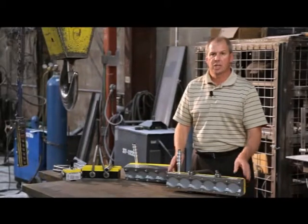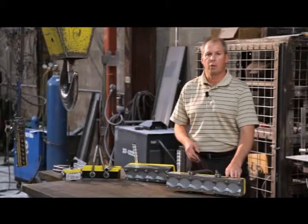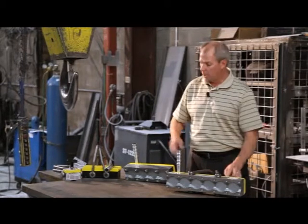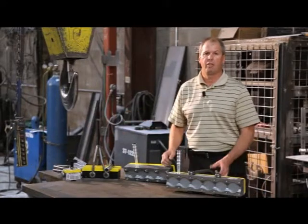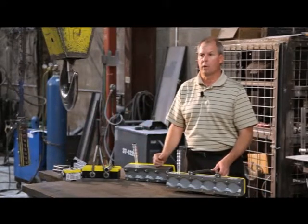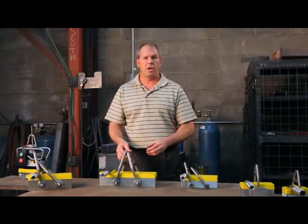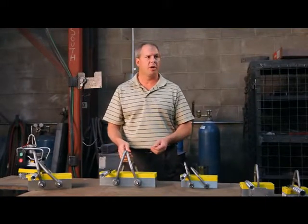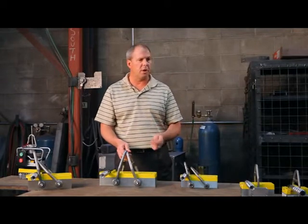Here's the full range. Our largest lifter is the 6,600 pound, 2,100 pound rated breakaway. Then the 4 by 1,000, the 3 by 1,000, and the 1 by 1,000 — which is 330 pound rated breakaway, at 3 to 1. Stronger, lighter, and stronger grip on thin material and in the presence of air gaps with MagSwitch. That's what you get with our technology.